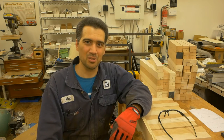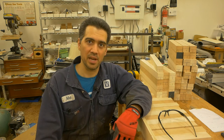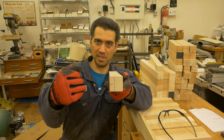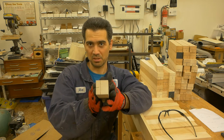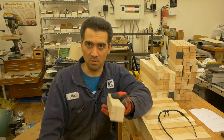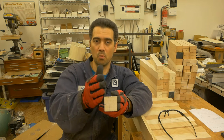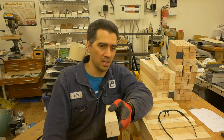And this brings an end to this week's video. I must say, not everything worked according to plan. For example, when I was cutting the maple pieces on the bandsaw, I found out the bandsaw blade was deflecting more towards the piece, and my target of 4 centimeters now got reduced to 3.85, which is not a big deal. I mean, it's only 1.5 millimeters of difference. The cherry, on the other hand, for the majority, the bandsaw was deflecting away, and I had extra material on the cherry, so that was kind of weird behavior.